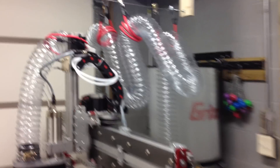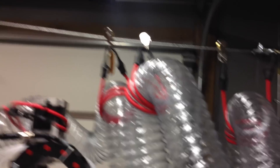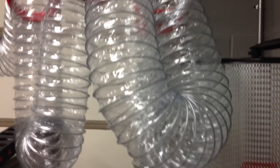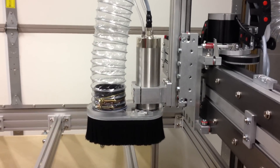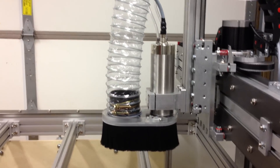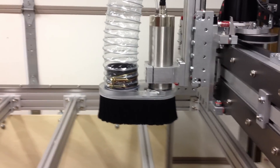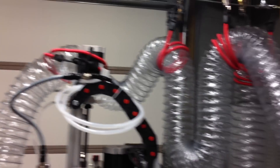One of the advantages is that it's lower on this end, so the tube tends to push on itself a little bit more to get it all bunched up at the end. It works pretty good — I end up with lots of loops at the end, so I'll probably lose a little efficiency when cutting on this end. It's moving fairly fine dust; I wouldn't expect it to be moving a lot of large chips. With the dust skirt on there, I think it should contain a lot of that stuff, and I should still have plenty of face velocity to move everything through.